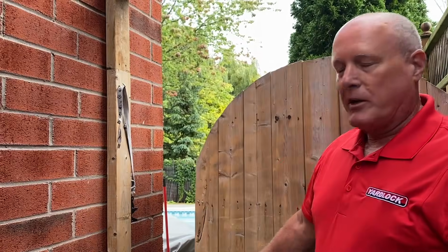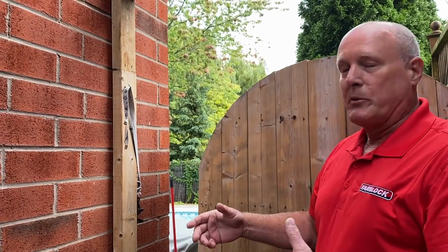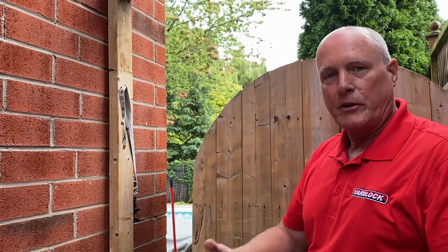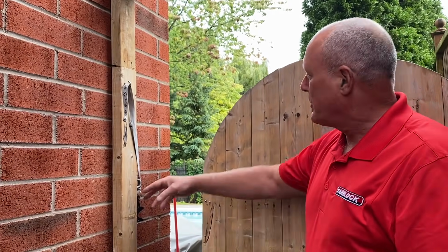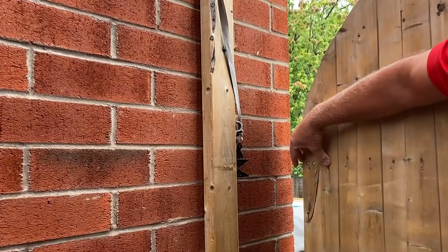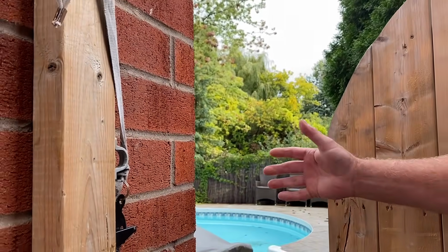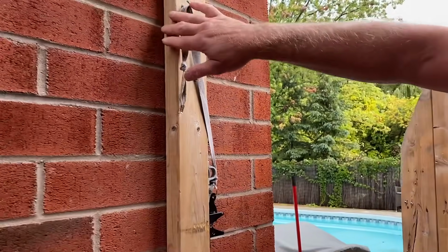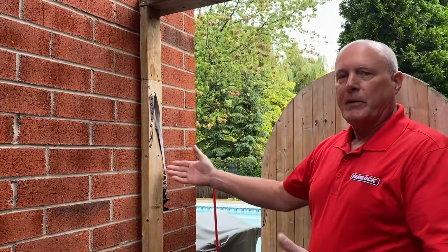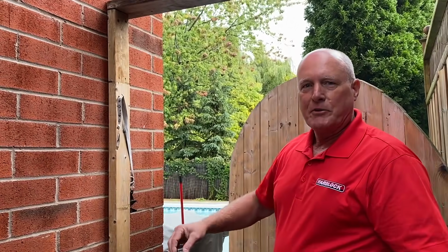Speaking of door stops, when you go into your house, you have a trim around your door inside. Well, that's your door stop. So when the door slams all the way, it doesn't go onto your lock. In this case, you have a heavy wood gate and it's slamming, and you have a latch here, which takes all the weight of the gate when the wind catches it and it slams. So we're going to mount a 2x6 here, so when the gate closes, it hits the 2x6, acts as a door stop, and it also provides enough room for Ed to have his new yard lock.